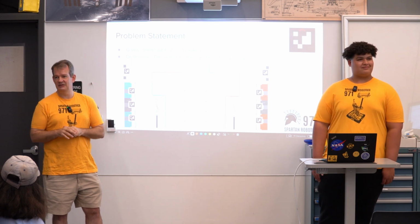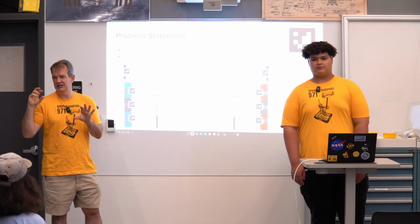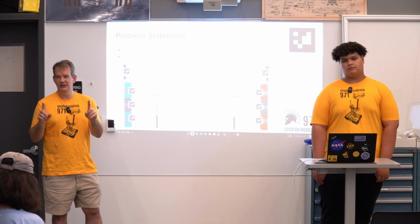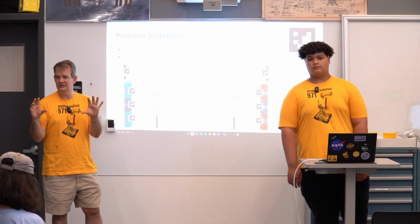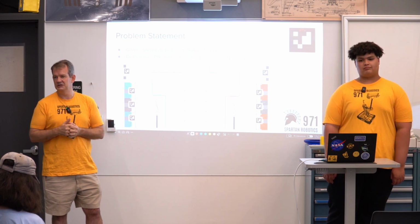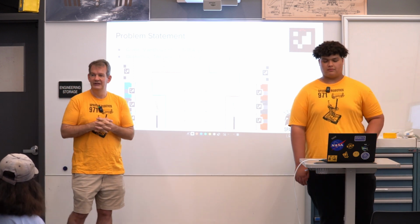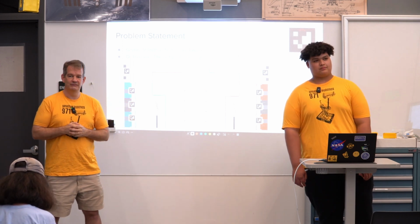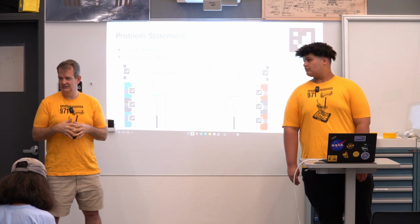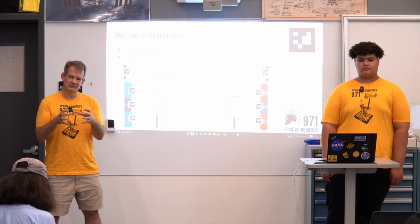Actually, I saw Austin spend some time looking at that and trying to figure out whether the performance of the April Robotics libraries in terms of speed of computation was better. So we've shifted towards the April Robotics libraries. Ceres Solver is just a nice open source solver that plays well with Eigen to do 3D solving and the transformations. Eigen's been a great library, again, for just 3D transformations. It does all of the mapping that we need for this sort of thing. But we're always evaluating what libraries are out there. Austin and others have been working on how to speed things up. That's always going to be an issue with processing images. And the Halide libraries have been really good for getting things to move faster, in terms of assembly coding different parts of it, so you can sometimes optimize pieces of that.